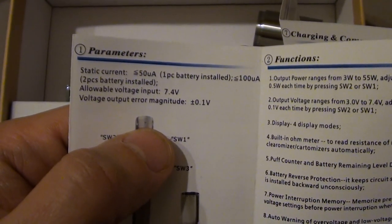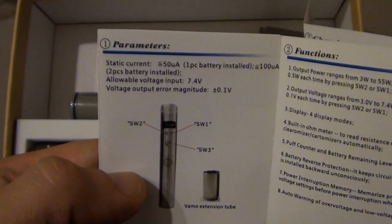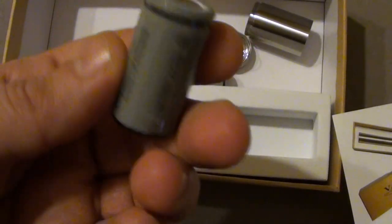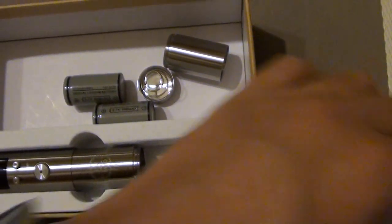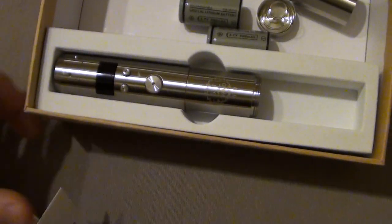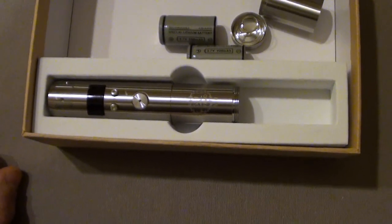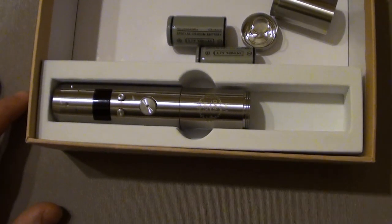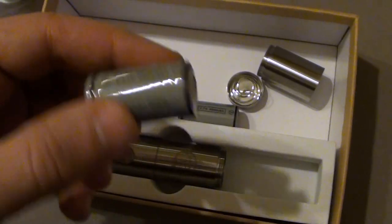As shown in the manual and on the website, there is mention everywhere of the possibility to run the mod with just one battery — for example, to make the mod a bit shorter, using just one 18350 or a higher-capacity battery. But the problem is — and these comments were not on the website when I ordered — this mod, because of the board inside, will never work with just one battery. Let me show you what happens with one 18350 inside.